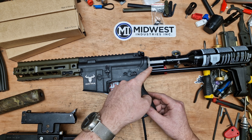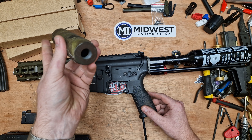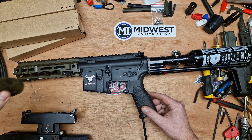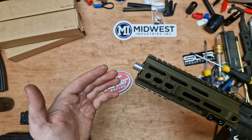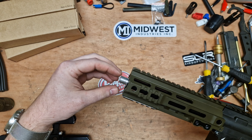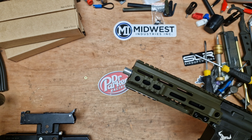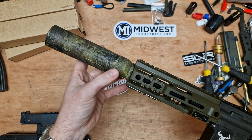I've got to route the airline as I said. The suppressor will be going on — that's one of the last machining jobs, to get that to fit a 14mm counter-clockwise thread, because they're 16mm normally. In hindsight I was trying to keep it versatile by putting the 14mm thread in there, so if James switches it up and wants a flash hider or whatever, most airsoft accessories go straight onto a 14mm negative. If he was only going to use this suppressor I would have just done 16mm clockwise.